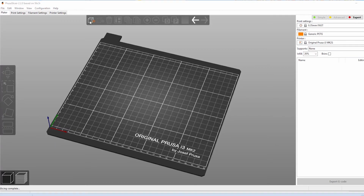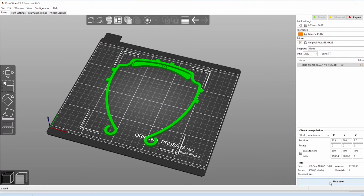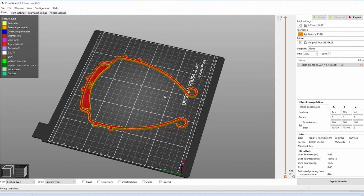Many of the experiments focused on removing different sizes and configurations of parts. These experiments found that the system was able to remove most commonly sized parts, with the largest issue being parts which were thin enough to flex with the bed. This project could be expanded by investigating the storage portion of automated printing and integrating that into the system to group parts into specific collection areas.